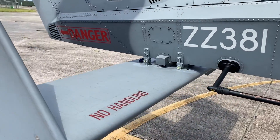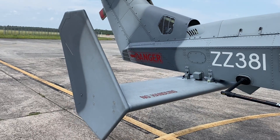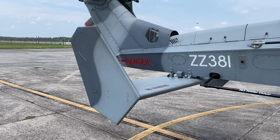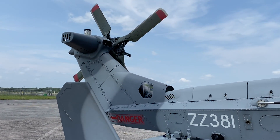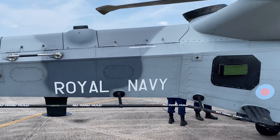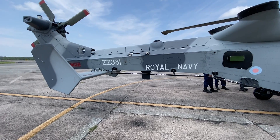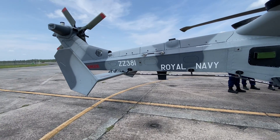So this is the horizontal stabilizer, vertical stabilizer. These are smaller but a little bit thicker — they might have more aerodynamic effect because of the shape rather than sheer size, because our Fenestron and everything is huge. You've got three aerodynamic surfaces vertically, all angled to offload the tail in forward flight. And then the horizontal stabilizer — at high speeds the aircraft wants to pitch forward, so it provides a downward lift moment to level the aircraft and give it a more level attitude at high speed, just like a spoiler on a fast car.